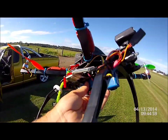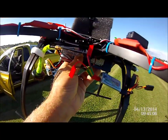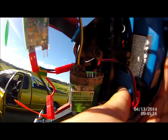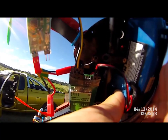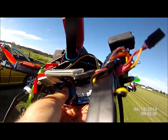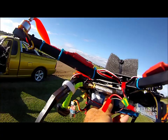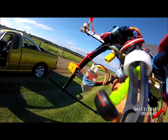For the wiring: because the Möbius has got its own battery, all you're using is your video signal and ground — so yellow and black. I've taken the other leads out of the Fat Shark; I've taken the audio leads off and the power lead, just so I haven't got live power running around. Basically, that comes out of there and goes into the on-screen display, straight up into here — pretty straightforward. The power just goes from that filter; you plug the battery into the filter. You don't need an alarm if you can see your battery voltage on screen.